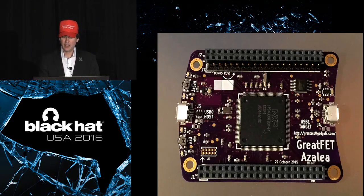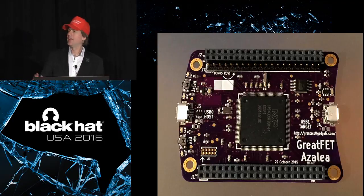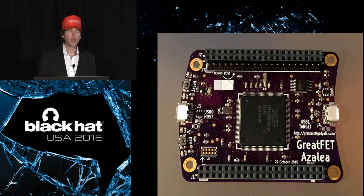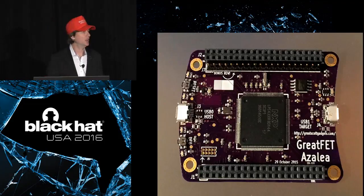It's primarily a one-chip solution, one big chip, but then there's a bunch of extra components for various functions. The highlights are that on the left-hand side there you have a USB interface to your host computer, just like you always did with GoodFET. In the middle there's a big microcontroller, just like there always was with GoodFET. But now it's a much, much more powerful microcontroller. It's a 32-bit ARM Cortex M4 that operates up to 200 megahertz. It's the same chip, or nearly the same chip, as the one that we put in HackRF1.